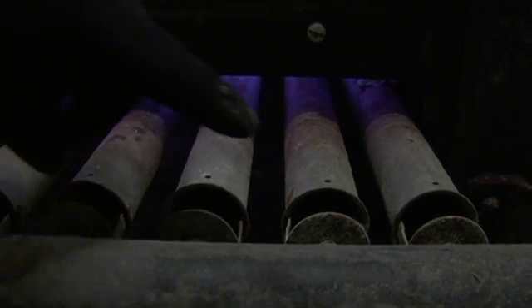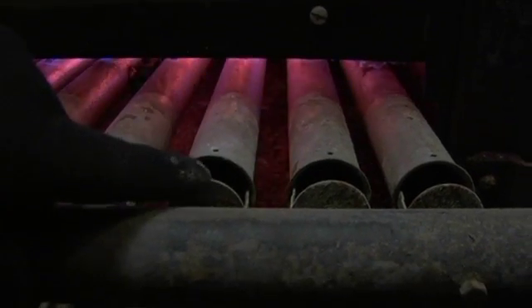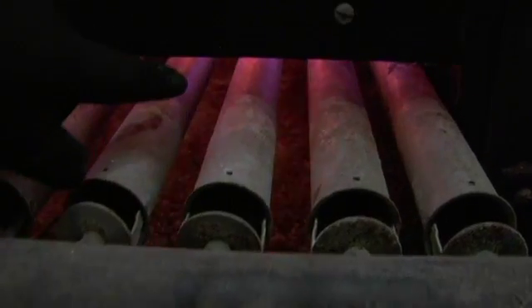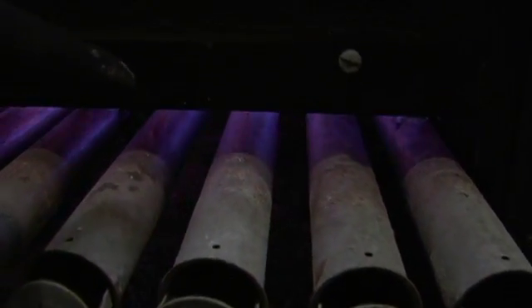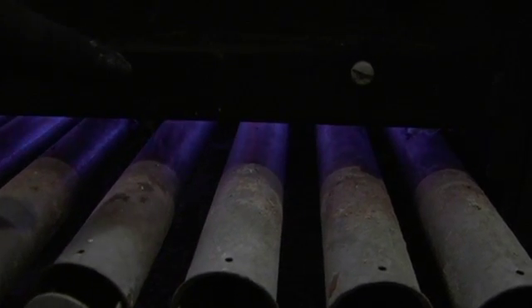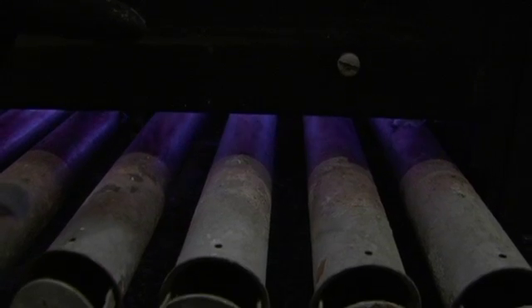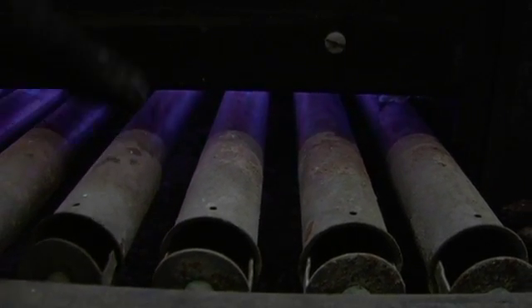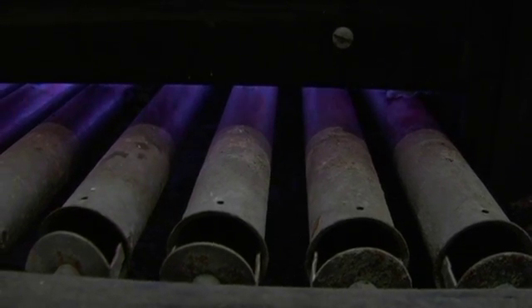Right here is where the air and the gas mix to get your combustion mixture correctly. And inside there, as you can see, all the flames are coming off each of the burner ribbons. That's very important that it's clean and clear, because if that flame is blocked or redirected, it messes with the mixture of the air and fuel and causes even a gas-fired boiler to soot up.